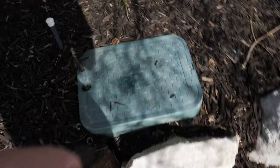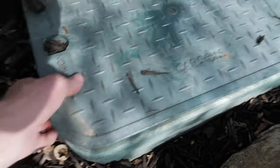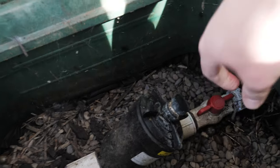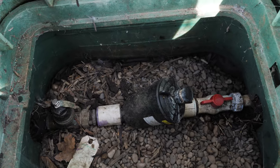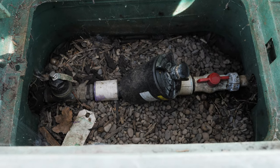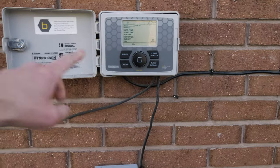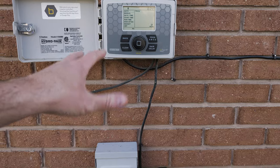I've got a box there, one up there, and then this is the main control valve for the secondary lines right here. If I were in Georgia this would terrify me, because what's out here wants to kill me every time I open these things. Not too bad for me because I've got a secondary line coming into the property — I've got my own shut-off valve for that second line. When the company that controls that secondary water tells me that the lines are charged from their source to my property, I turn on the zones manually using the control box and the app.